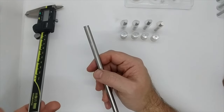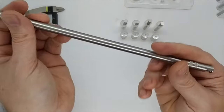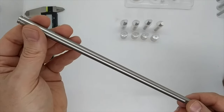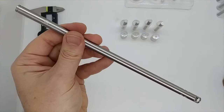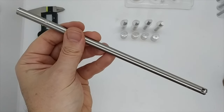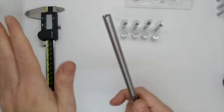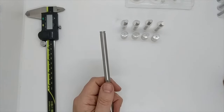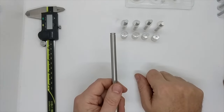This caliper was about £120 — you can get ones for £30, and I imagine if you were building something for NASA and needed to measure the total inner bore, you'd be talking thousands — maybe £50,000 to measure something like this. But this is the best we've got, and that's where pin gauges come in. A pin gauge is just a highly machined bit of metal.